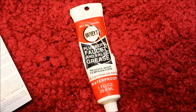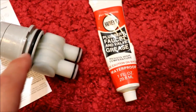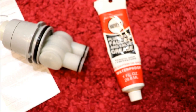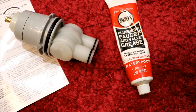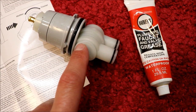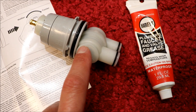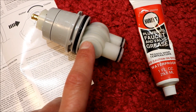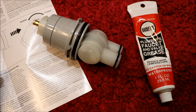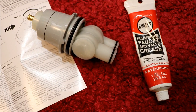I'm going to put a little bit of plumbing grease on these o-rings here just to help guide it in because there are some rough edges. Reading the directions: do not twist the cap and lower housing of the new cartridge to take it apart - which is what we did with the old one. If for any reason they come apart, make sure they are locked back into position, because otherwise you'd have issues with water coming out of your faucet.